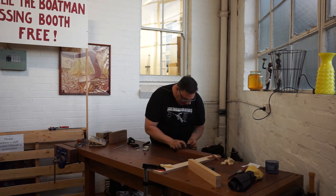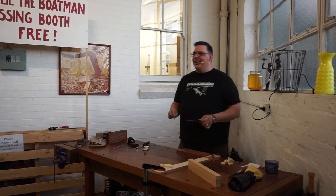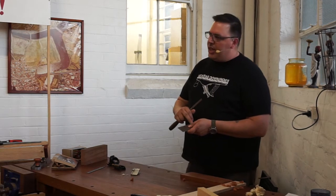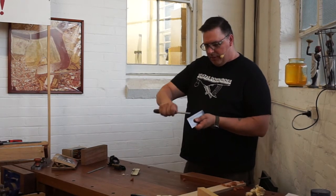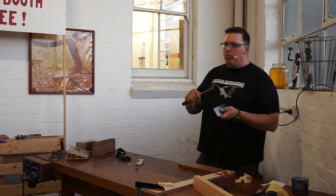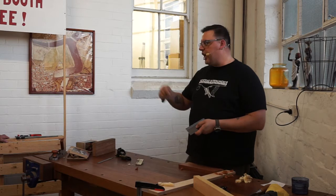It doesn't matter which way you go in the grain. I will warn you though, this gets warm — get some guard tape and wrap your thumbs because you'll burn them. If you start to lose that edge, all you have to do is put one on again. Because you didn't do all those extra steps to start with, you can do about four or five subsequent sharpenings before this gets too hard to turn. Once that happens, you go back to the file, rip that steel off, and you're done — just carry on again.